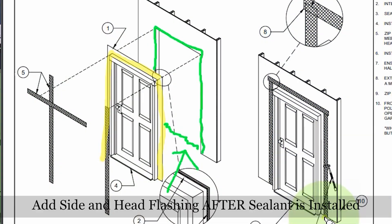A lot of people fail to put that extra bead of sealant on the inside, and again this is if you're using foam insulation. You want to make sure you seal the flashing and the ZIP to the outside, and also put an additional layer of caulk or sealant before you install the trim. This prevents the air — which is carrying the moisture — from getting through the system. Now, with some of these systems, it doesn't matter how well you design them, water is going to get into the system. So I want to talk about some of the points I noticed on our particular installation and why these are not bad, but probably not the most ideal way of installing.